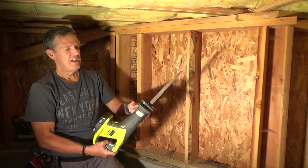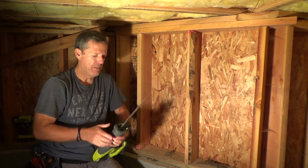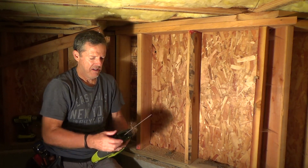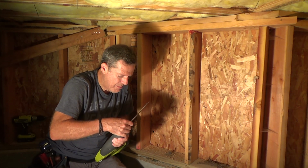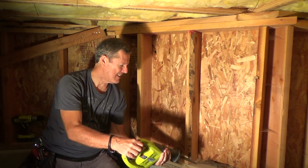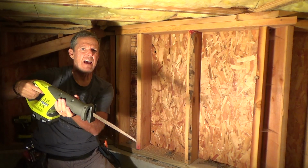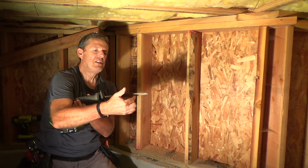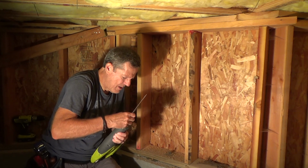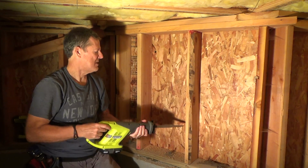And in the old days, see, so I have that, the blade is facing down and it's closer here, but you can flip it around. And in the old days, lots of Sawzalls, you couldn't put the blade that way. You had to flip it around and put it that way. And see how, if you wanted to cut a piece of bottom plate, let's say, and you had concrete, you've got the whole saw and you'd have to cut at an angle like that. And pretty soon you're only using the tip from here until there, and the tip gets worn out. And so I always like to put it this way. Then you can cut right down flat to something or up to the sides or whatever.